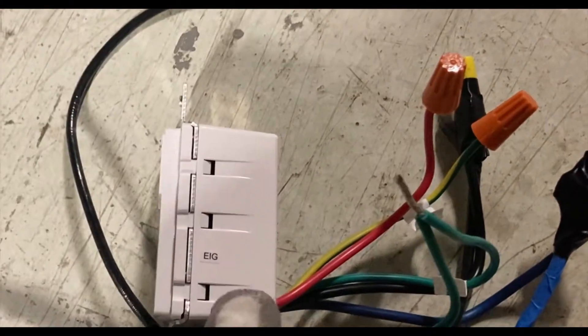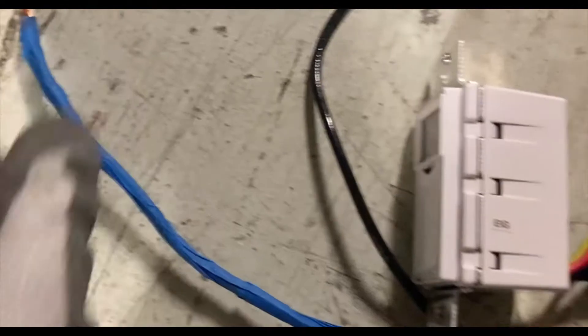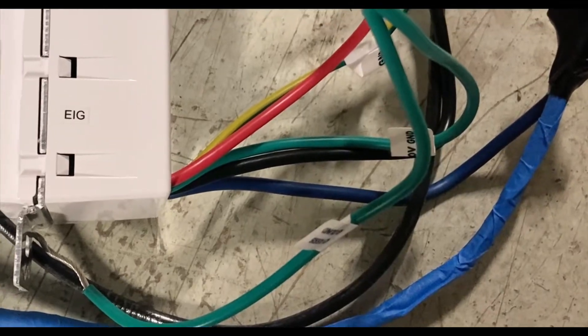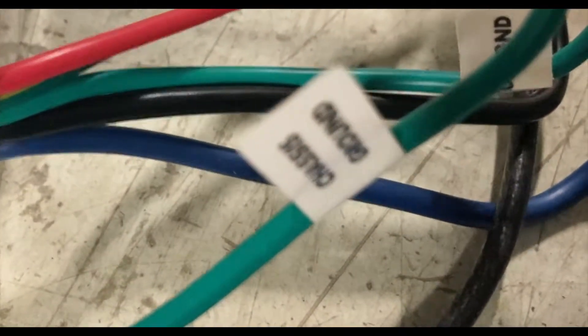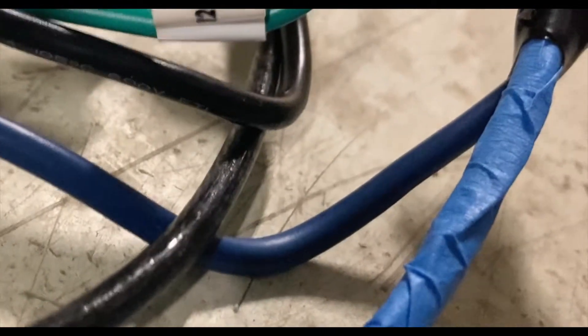Here it is all wired up. The blue wire is power going out to the motor; in this case, black is hot — 120 volts coming in. You can see how the chassis ground and the 120-volt ground are spliced together per the wiring diagram, and the red traveler wire is capped off because we're not using it as a three-way switch.